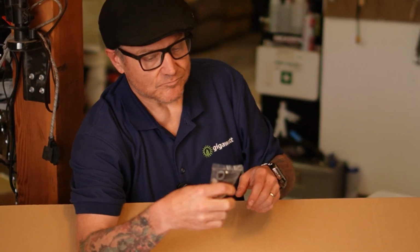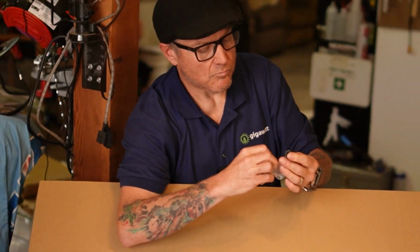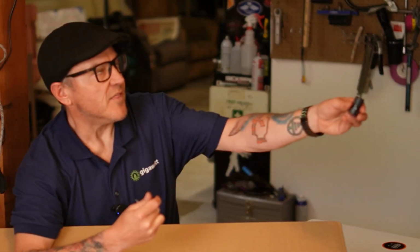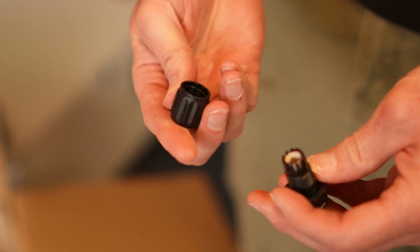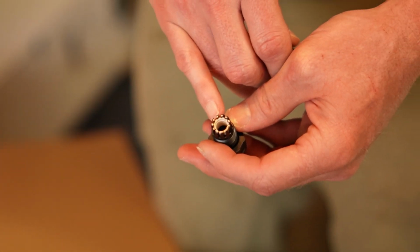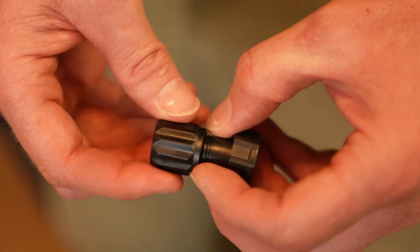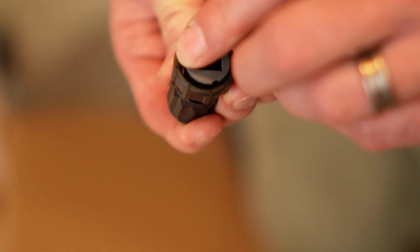If this thing is rated for outdoor use, everything needs to keep that in mind. Every wire that's coming out, every screw, can't have something as simple as a terminator being exposed to allow water ingress. And it's a basic cable gland that's got the rubber grommet and the plastic fins that just clamp down onto it, like on an old school combiner box. So you can see the seal, the rubber in there, and then when this thread's on there, it compresses it around the wire so no water gets in there. And then this is threaded too. And then that's rubber.